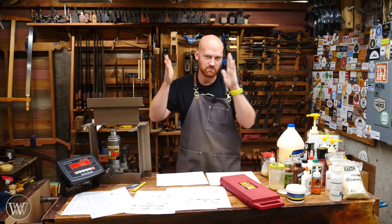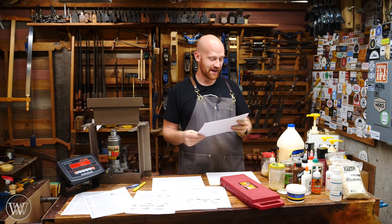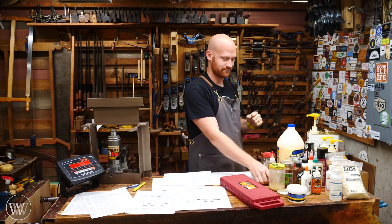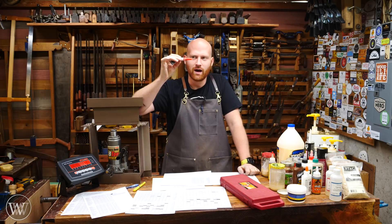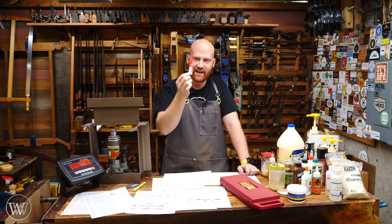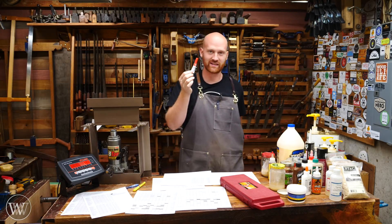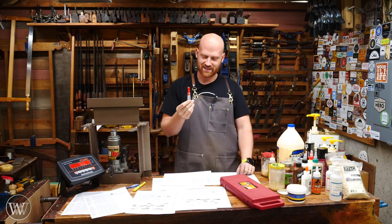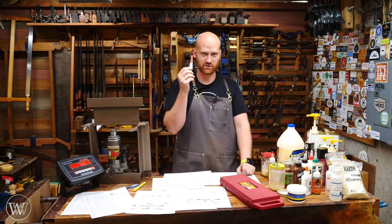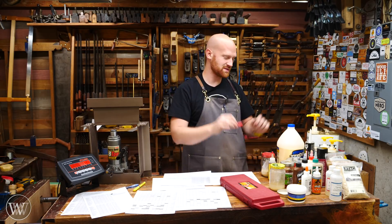Let's jump into long grain to long grain, the most common glue joint. The number one long grain to long grain glue was cheap super glue — that blew my mind. This is stuff I bought at the dollar store, and it was phenomenally good, significantly better than most other glues. That said, the amount of force it provides is far stronger than needed for any particular joint, even with a sloppy joint. Coming up closely behind the super glue were actually the epoxies.